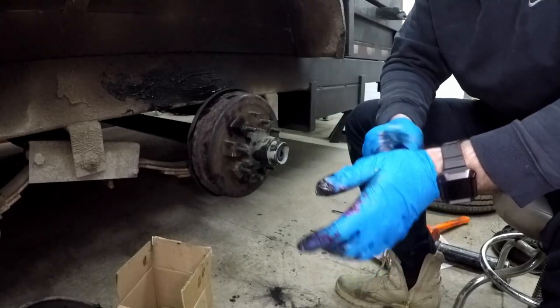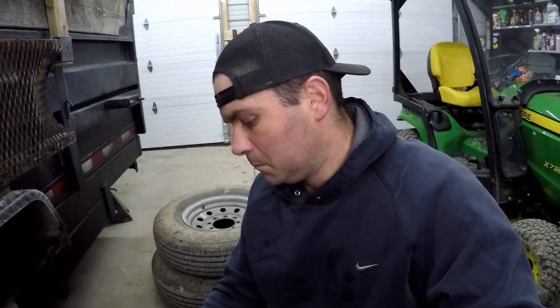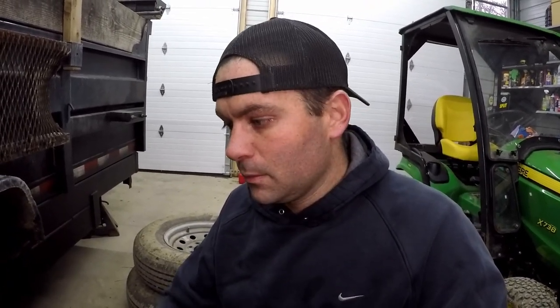And that's how you do trailer bearings. Not a hard job — might seem a little daunting, but it really is simple. Just take your old bearings into the trailer store and they'll match them up. It's super important that you use high-temp grease — usually fully synthetic. Don't use regular all-purpose tractor grease; it's not made for the high temps that wheel bearings reach and it'll break down super fast and get liquidy. I'm going to finish doing the rest — the other three — and fix the brake. I hope you guys learned something today. If you have any questions, feel free to leave a comment below.